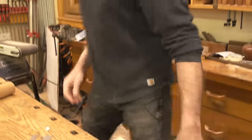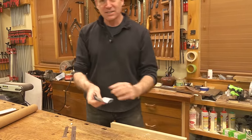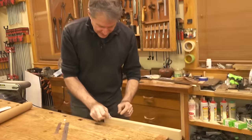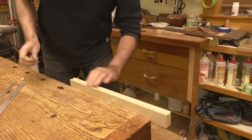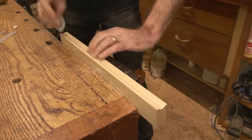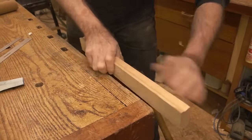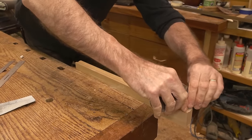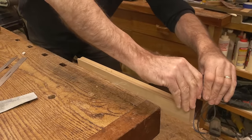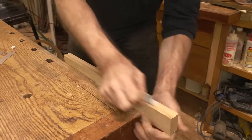So I'm going to take a piece of sandpaper to get into this cove — just fold it. It's 150 grit. I'm going to set it in there. Whenever you can sand something long like this, it saves a lot of handling, because we're going to cut this into four segments and we can do it a lot faster like this. Now flip it and I'm just going to repeat the same process — find that sweet little spot on the French curve.